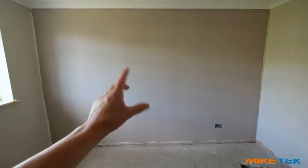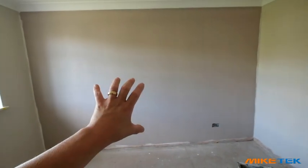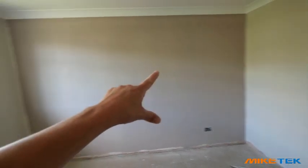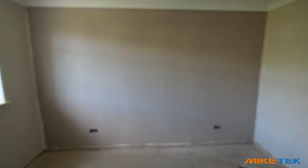The feature wall is almost done — probably needs one more coat. Down the sides I haven't cut in, and that's because we're doing panelling on this wall. The panels go in the corners either side, so we just made sure the roller head went as far as possible to the sides, and the panelling will cover those corners. It's the next morning — we've noticed a few dings and stripes on the walls from where the plaster caught. We'll knock up some wall filler, fill these over, give it a sand, and then give the walls another coat of paint.